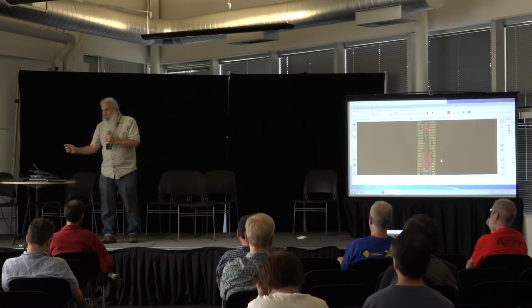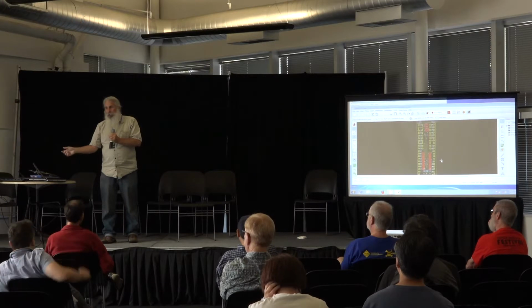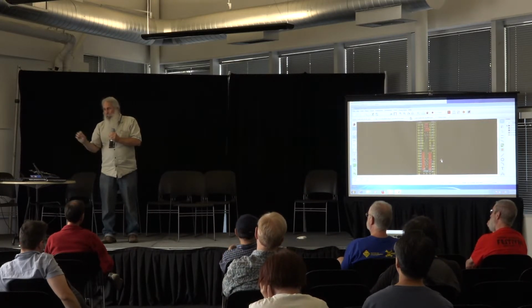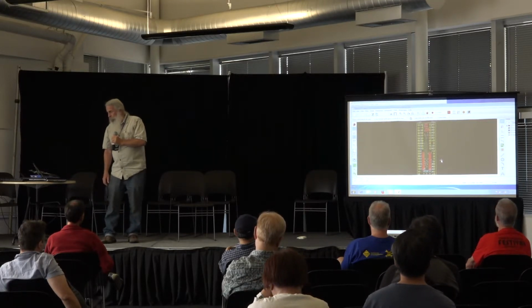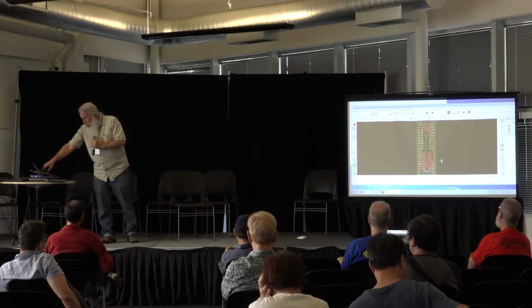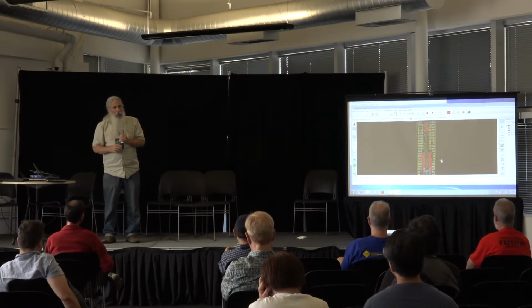The first time I did it, the pads in my first version were a little narrow. And at that time, I could only hand solder because I don't have an oven to heat them in. Hand soldering was difficult if you can't heat the pad and the lead at the same time. So I made the pads a little wider. There was enough room there. You can see there's enough room for the routing and stuff, so I was able to get all the routing that I needed there. There were a couple cases where I had to, because, if you look at it, anytime you punch a hole through, you lose some routability space. This is one of the things people don't really grasp sometimes when they look at how many layers you can put on some project.